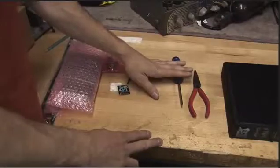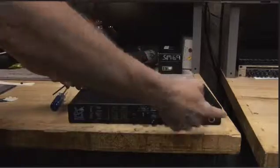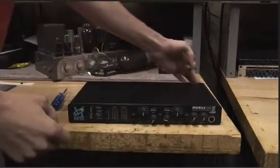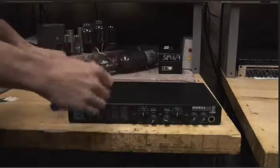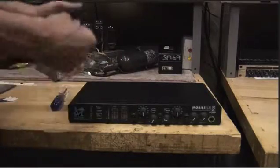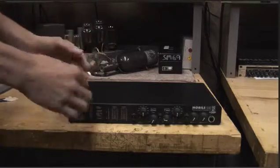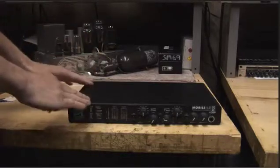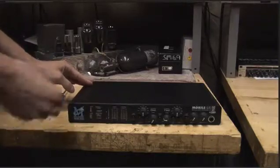Now let's dive in. We're going to use our 7/64th hex wrench to take out all the screws on the front panel and the back panel. The ones on the side — the long ones — we need to keep those separate so we don't damage this when we put it back together. Now keep in mind, you're opening up an electronic device, electrostatic discharge could happen, so ground yourself somehow and try not to work on your 70s shag carpet.